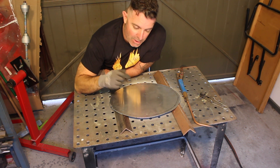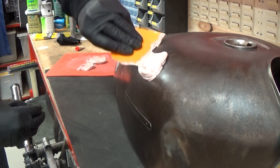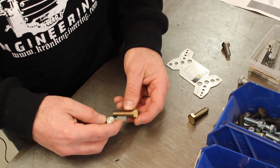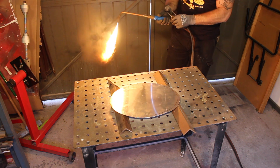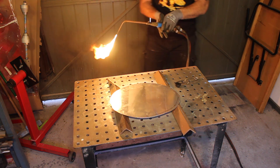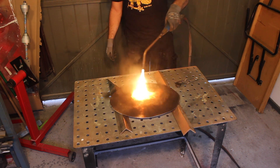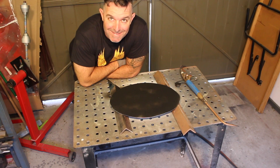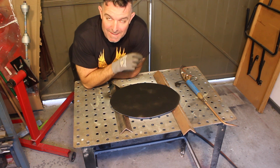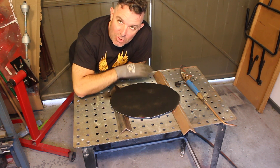So I'm going to do a demo and you guys can follow along. That first step is very simply just using an acetylene flame — there's no oxygen mixed with that flame at all, it's just pure acetylene. You can see how sooty the flame was, so what we're doing is dusting this surface with that soot.